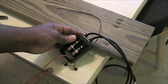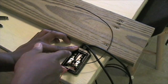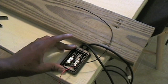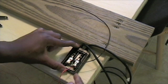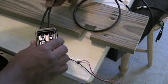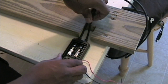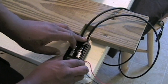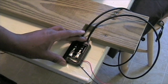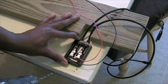I have my two holes coming out of my plywood and I'm positioning the junction box here. I'll probably just drill two holes and put two screws in the middle to hold it down, then go around it with silicone. I also cut a strip out of the plywood so my wires coming out of the side of the junction box have a little room to move around — it was too close at first. That way it won't be too tight and possibly cause problems later. Just something to keep in mind if you're going this route. Now that the junction box is in place, I'll take my drill and start drilling the holes.